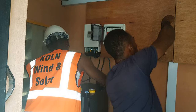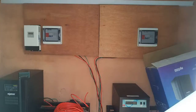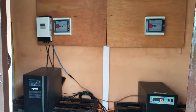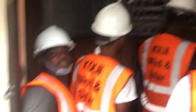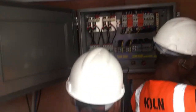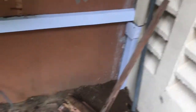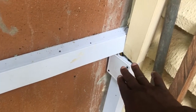The installation is in full swing and the boys have put up boards, MPPTs, and AC boxes. We've also rigged the inverters up and tried to power them up initially. We were able to identify that the homeowner's pre-existing 3KVA inverter had problems, and were able to talk them out of going forward with it. Instead, we're putting another 5KVA inverter to balance the system out — so two 5KVAs on either side. We're putting in the DC twin DC box; this is the very first time we're using it. We've also got a main earth bus bar that goes straight into the ground to a main earth conductor for this outbuilding.